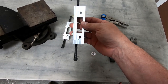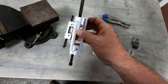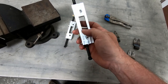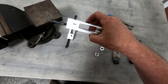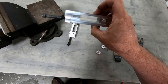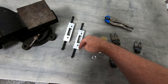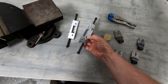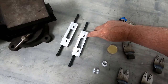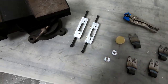As I said, I did make these slightly larger, and these are 32 millimeters top to bottom instead of 30. It just gave me a little bit of extra room with getting these bolts in here and compensating for the fact that the gear is a little bit taller, being 5/8 versus the metric measurements that are in the plans. So I'm very happy with these. I just obviously have to do some cleanup on these, angle some of the edges, round everything off. I'm just trying to get these to the point where I can start doing some test fitting. I think today I might go back and do the angles that need to go on the end here and shape these a little bit, but we'll see.